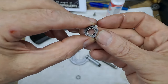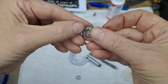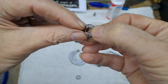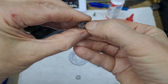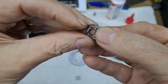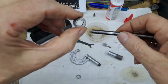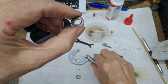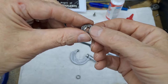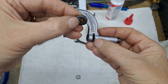The locking ring I've left as three pieces. Very, very ingenious little mechanism — there's the main ring, there's the inner ring, and then there's this tiny little pin. If I move it that way, you can see that little gap there — that little split in the inner ring — and if I move it, you can see it almost closes up. What that does is it makes that hole just small enough to clamp onto the shaft in whatever position it may be. The only thing that holds that into the micrometer is the shaft going through the middle, and that little spigot goes into that little slot. Very clever — no locking screw or anything.